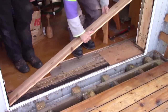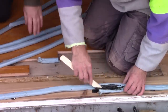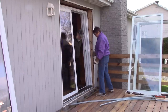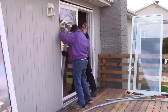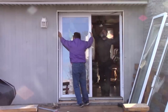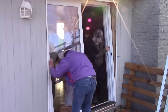Because the new door is smaller than its opening, I have to add a piece of cedar at the bottom. Then we're ready to install it. I use caulking to glue a styrofoam to the wood and we install the door. But we have a big problem — there's a big gap at the top of the door, about one and a half inches. So I add another piece of cedar on top and we try it again, but it's still not enough. I go back to the workshop and use another board of cedar that I plane to the thickness I need.